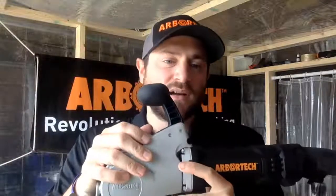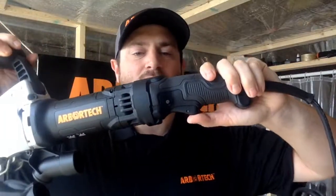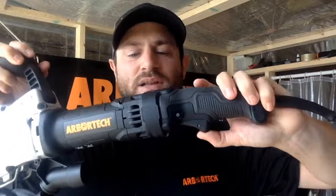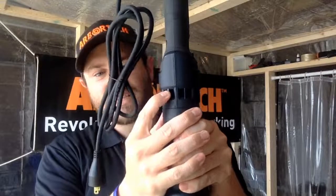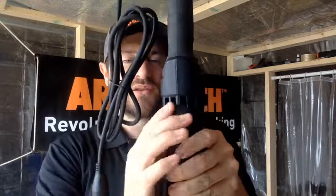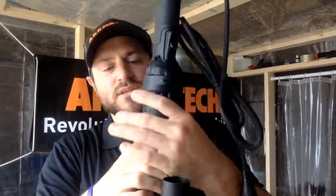In terms of the 1400 watt motor power, we have gone to some new electronic components as the update. So we've gone to more of a power switch back here on the unit. So you've got your safety toggle here, just a standard click switch. We've improved a little bit more kick out in terms of dust and sediment or anything like that in your mortar materials, just on the back for some more venting here that's going to come out of the actual motor and unit itself. It does go the full 360 degrees around.